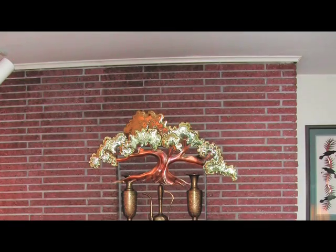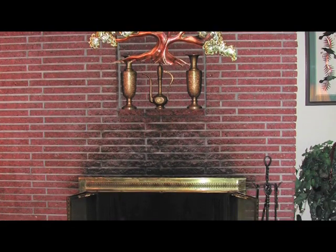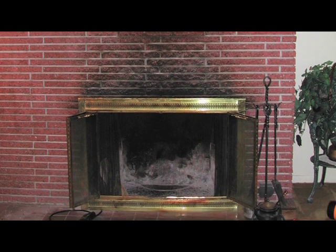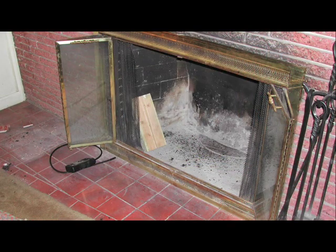The existing fireplace is a brick masonry unit in a Fairbanks home constructed in the 1950s. These fireplaces were commonly installed in houses of that era, typically have a very low efficiency, and do not contribute significant heat to the house. Converting this fireplace to a high-performance masonry heater will increase efficiency, burn less wood, and reduce fuel oil consumption while more thoroughly heating the home.